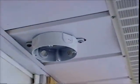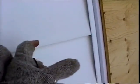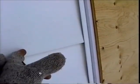There's going to be an outside light here. Those are the windows that have been sealed off. Later, once the inside is done, to improve the soundproofing, I'm going to take all this vinyl siding off and put a two-inch foam on the outside, which will increase the soundproofing quite a bit as well as improve the insulation value.